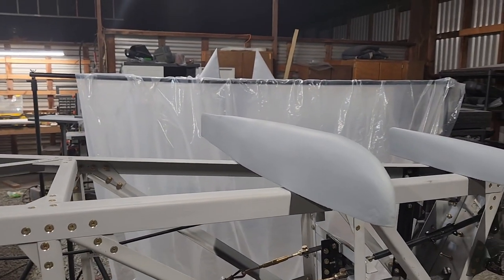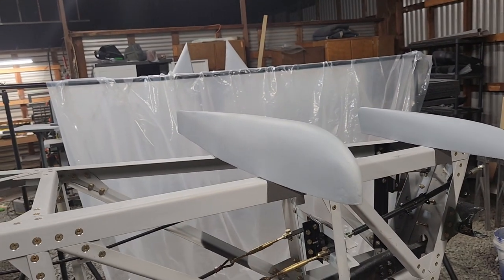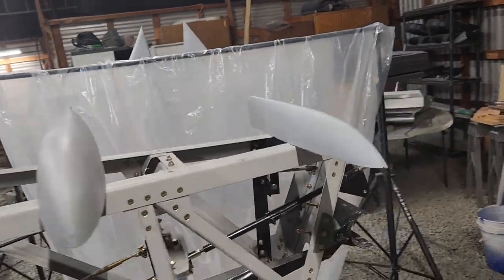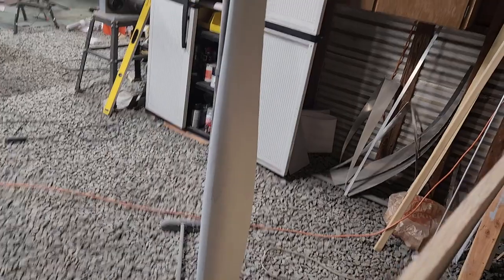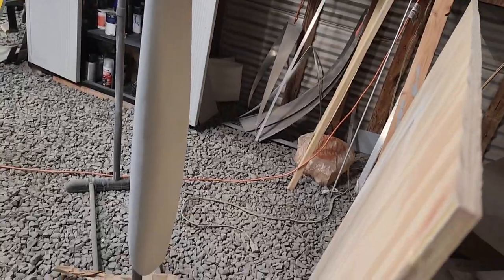On that note, the epoxy primer does not work well on these. It doesn't adhere very well, and it goes on so thick that it's just not usable for this. This is just a spray primer. And the same with this one. The lesson I learned after priming this one again is that it really needed just a very light coat of primer to cover the sanding marks.